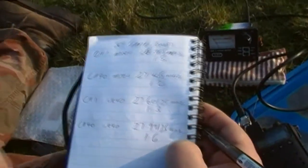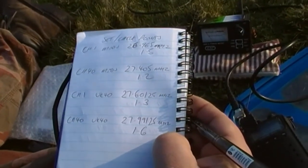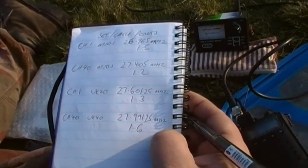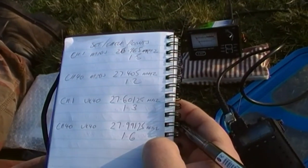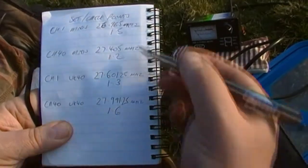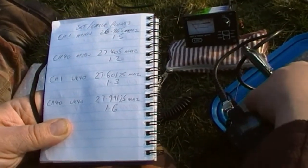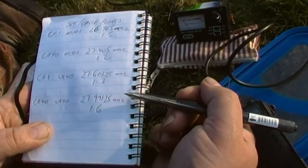No adjustment necessary — that's very good indeed. For an antenna that apparently has a characteristic impedance of about 70-odd ohms, those are the sort of figures that you would expect anyway. So that is great. I've not had to do anything to it. It's still folded over at 102 inches. Obviously you would make it longer or shorter to get your SWR where it should be, but I've not had to do anything so it shows it's nicely balanced.